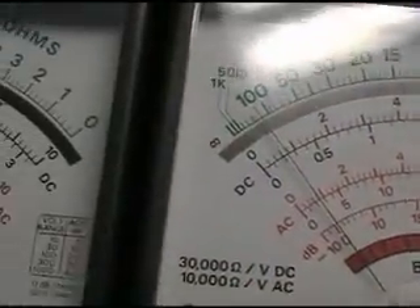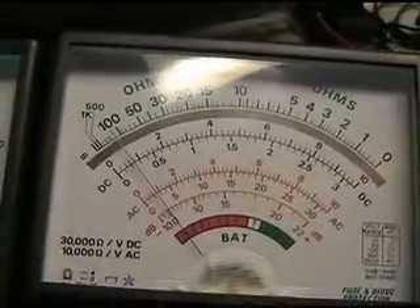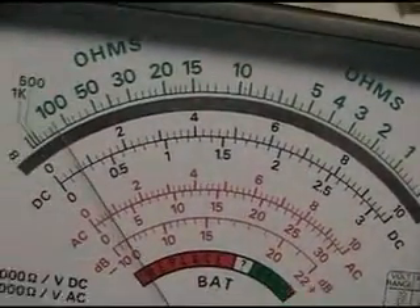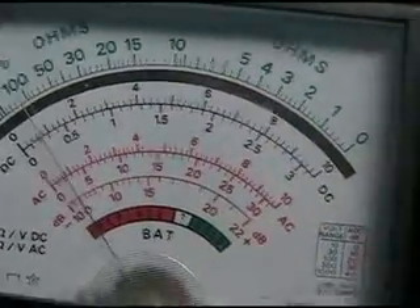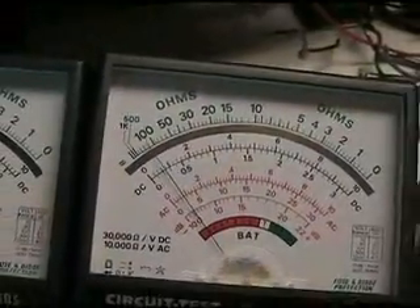And of course the voltage in one of the caps, voltage in the other cap. And the current it's using — about an amp, maybe a little bit more. I don't think I've got it set up just right. About 600 milliamps or 800 milliamps.